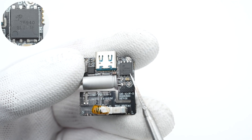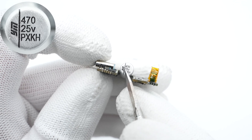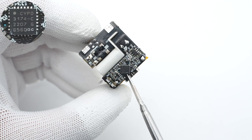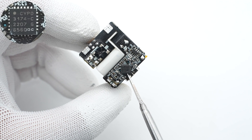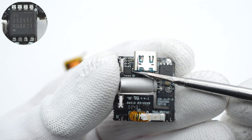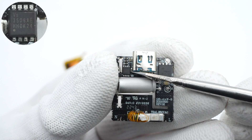The synchronous rectification MOSFET is from AOS. The solid capacitor for output filtering is from Yongming MPX series, 470μF/25V. The protocol chip is from Infineon, CYPD3174, which supports multiple fast-charging protocols. The output VBUS MOSFET is from Vanguard and adopts a PDFN3333 package, supporting 5V logic level control, 30V, 6A.